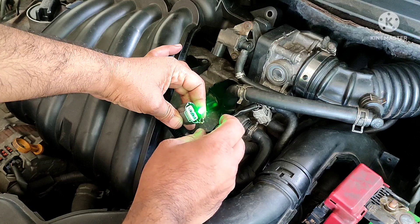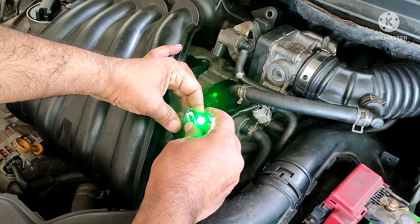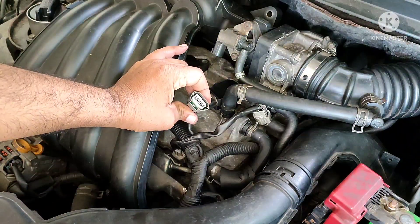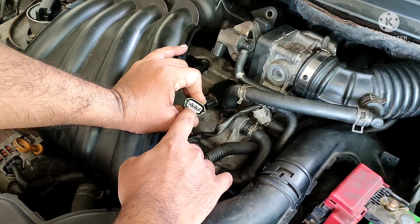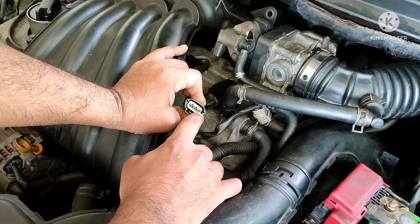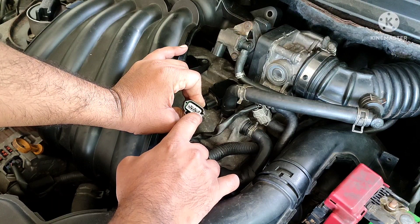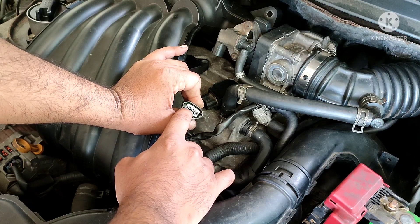This way we can find the wire connection without a multimeter using an LED. The center wire is the car minus voltage — the battery minus voltage — and the right side is the supply voltage at 12 volts, and the left side is the coil trigger wire.